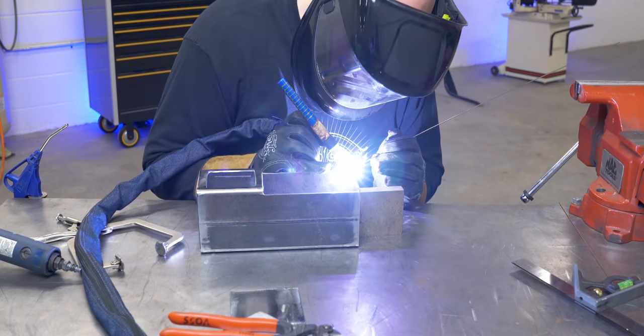Okay, I just noticed I have a problem with my door design. It's not that I put it under the hinge. I did that because it gets the door more flush here and less of a gap for it being so high. But the problem is, you can't remove this pin once it's in the box because the hinge is too wide and the pin won't get out. So the door has to stay on. But for storage, the top of this needs to fit down into here. So this needs to swing up out of the way, but it's too tall to close the lid like that. So the max length of the door cannot be any longer than what would reach the top of this. So I'm gonna have to cut the door shorter, and then I'll probably make it so it falls like that.